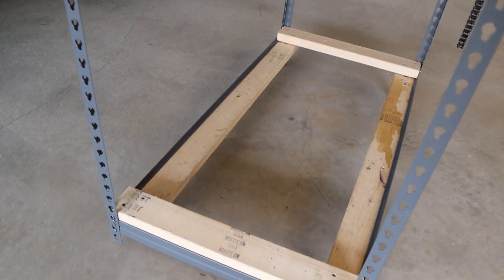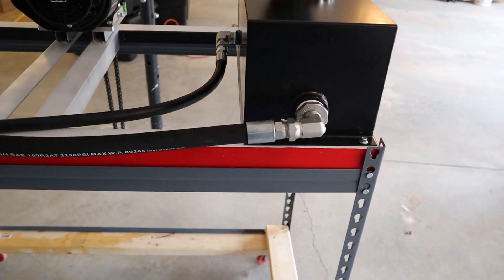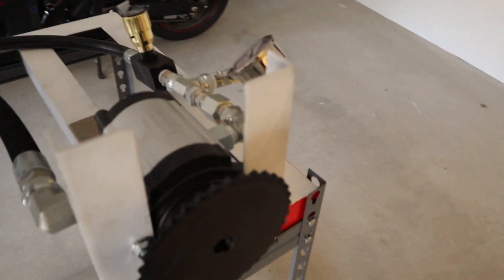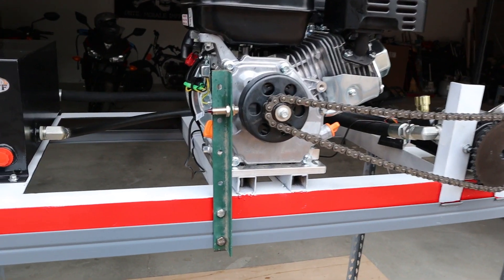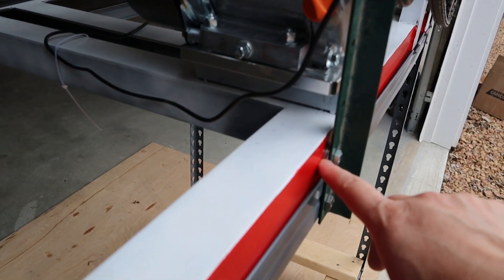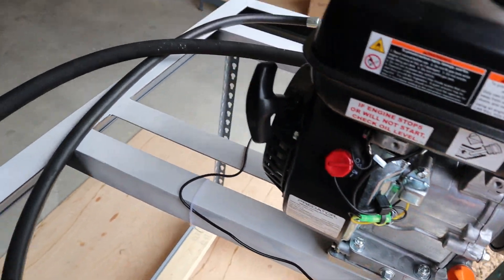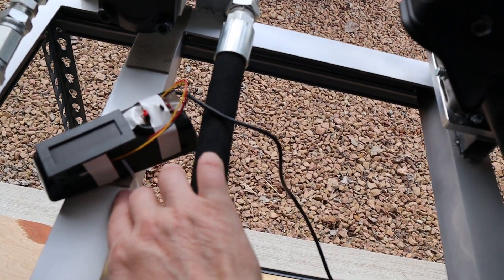I have the thing on wheels and it's moving. I have the leads coming in and out of the tank, the engine on the mount, my pressure chamber ready to go, the control valve, the gear on the pump, and the chain sized up. I threw on the tachometer quickly using a piece of 1-by-1 ground stake with pre-existing holes — drilled a couple of holes into my frame, added some washers as spacers, and drilled out a hole for the reader. The tachometer itself is held on by just a couple of zip ties so I can move it around as needed.